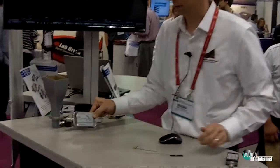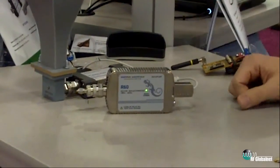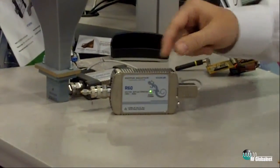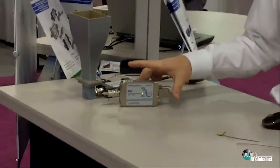To do antenna tests you need to do basically vector reflectometry — it's a one-port VNA measurement, an S11 measurement. That will show you how well an antenna is working and also what components can be added to the design to improve performance. These reflectometers are Copper Mountain Technologies' one-port VNAs. This R60 product is a new product we're announcing at the show. Its operating frequency range is from 1 MHz to 6 GHz, covering both ISM bands as well as the 900 MHz band — making it a perfect test and measurement tool for engineers dealing with antennas in the Internet of Things world.